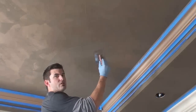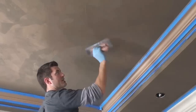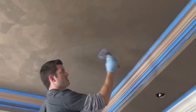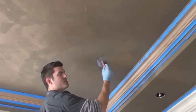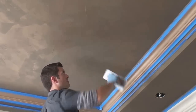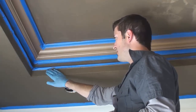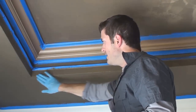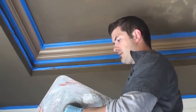This is how I hold my trowel. I don't do the baseball player death grip. I've got my fingers positioned so I can really move it around and get that organic movement really easily, and then I can easily shift and drop it into a corner and bring it around. It's just a little easier on your wrist too — so don't do the death grip. Now when I'm troweling this area, I'm just going to use my full-size trowel, and because I've brushed and rolled the coat on, that 90-degree edge is already covered for me, making it a lot easier.